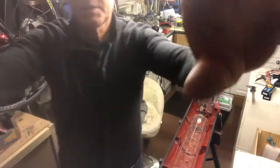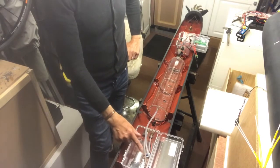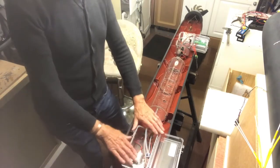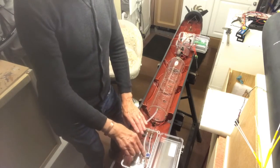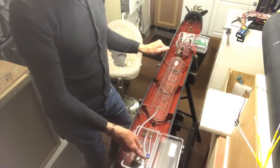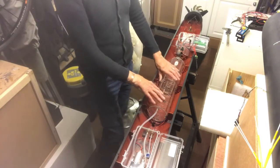When you want to surface again, there's an air tube connected to an air pump. In this first box we have the air pump, which we control from the transmitter — it blows air back into the ballast tank to push out the water. However, there is a problem in that it takes air from this box, almost creating a vacuum, which is not what you want. So we have a little solenoid valve connected to the snort on the conning tower — once that gets above water we can open this valve and air is drawn in from the surface.